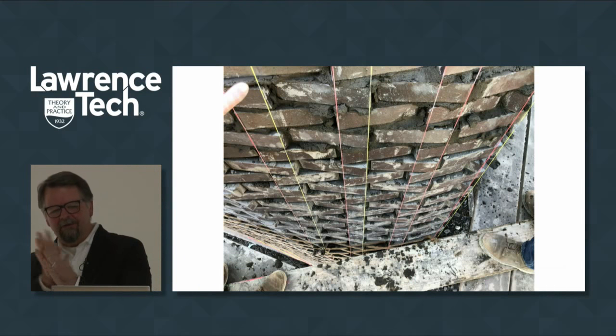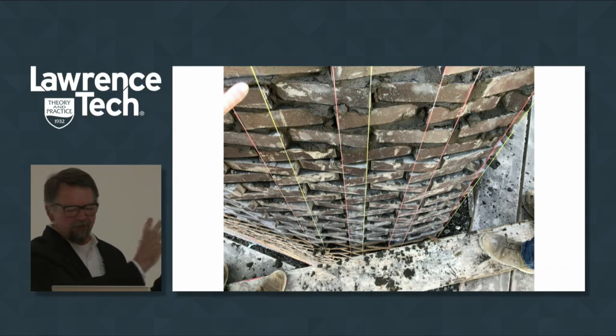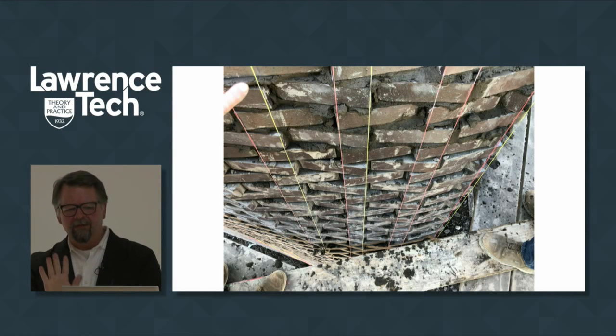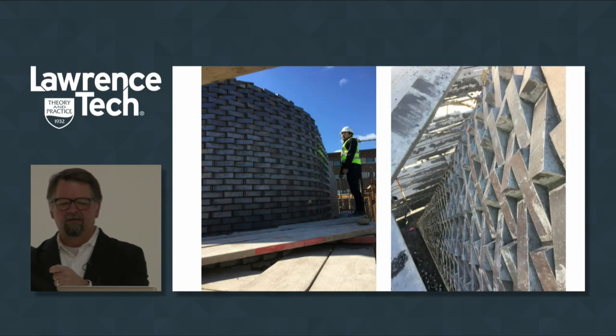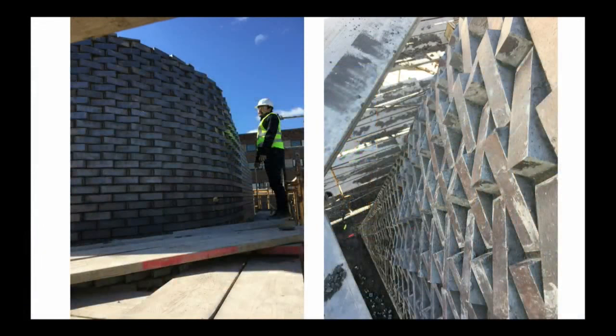And then the corner is really interesting. So those vertical strings on this corner of the building under this window, they're all simply straight strings. When it gets to the conical corner, the joints and the points of the brick are actually starting to wrap around. So every day he would reset his strings, mapping that corner around. And they did a pretty amazing job, but the other challenge of that corner has to do with just its direct visual impact.